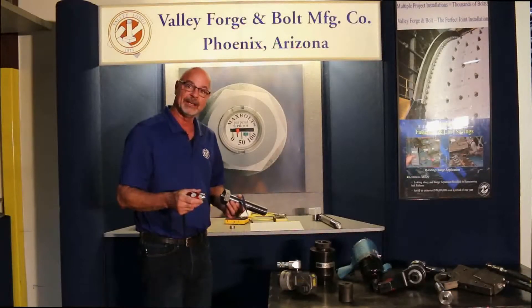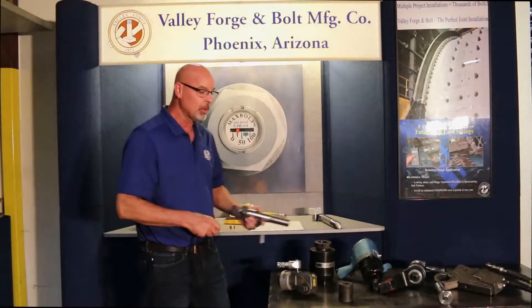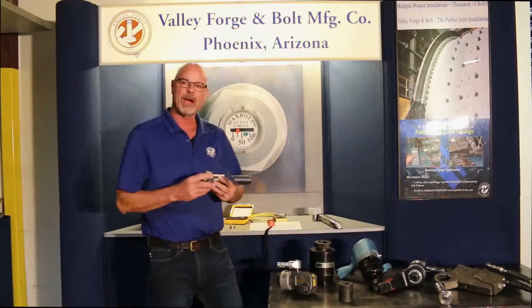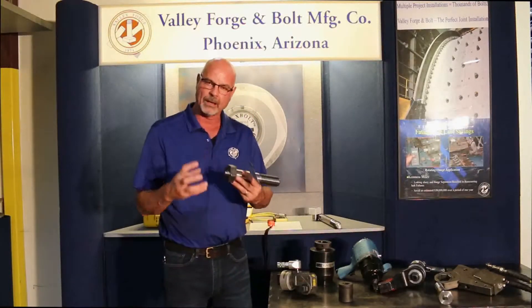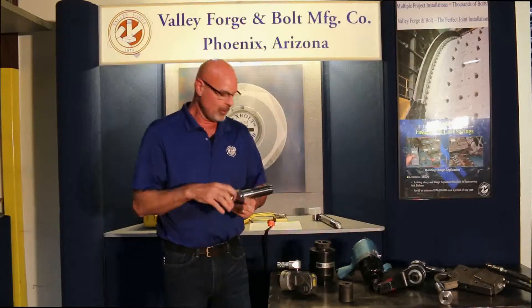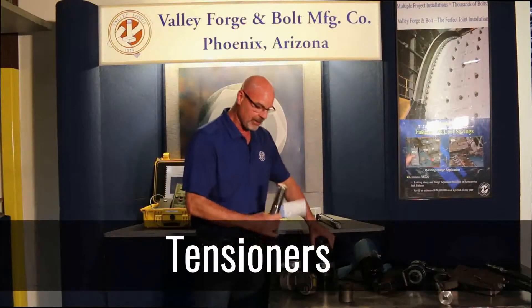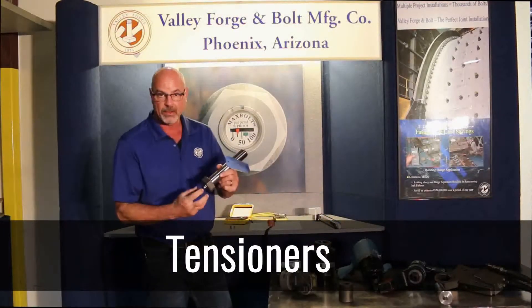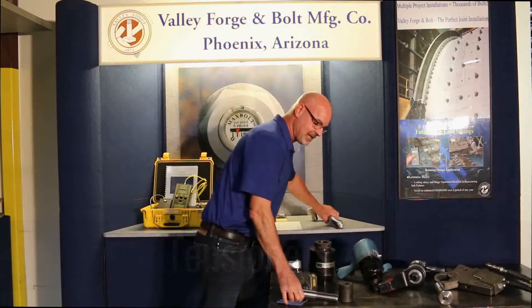In interfacing our meters with the torquing tools, the bolt is now a calibrated unit — a calibrated instrument — that you can use to put in and see load. How you achieve that load, whether it's in a tensioner that you have to screw onto something, adapt, tighten it up, and read the SPC4 from the other end or from the tensioner end.